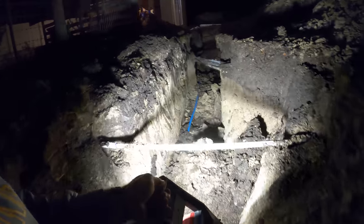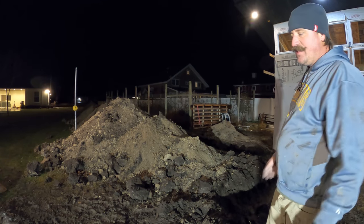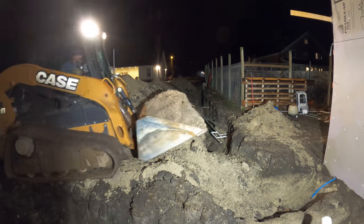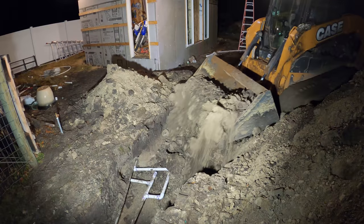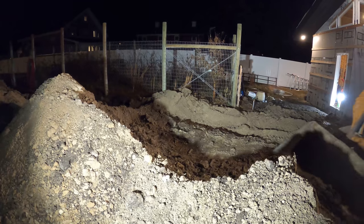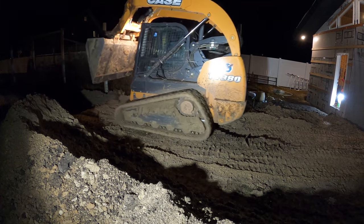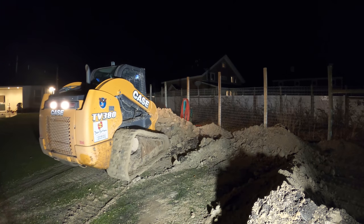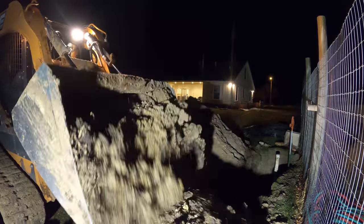This trench is about four to five feet deep — you have to have it that deep so the water line doesn't freeze. I got a little carried away with the excavator but I've finished everything I need to do so now I can backfill, other than this stupid sewer trench. It's never in a million years something I'd recommend driving a skid steer on your lawn for, but it's a small sacrifice to get water and power to my shed.